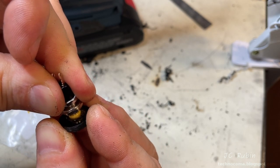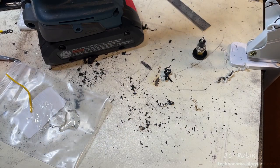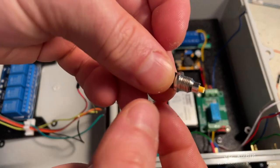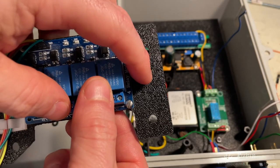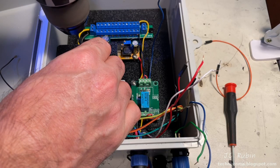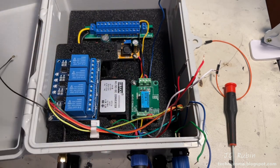I got ahead of myself — once you put the top piece on, there's no way to screw on the button through the board since it's through-hole. So I ripped that off and will put it back on later once I drill a hole through this board so it sits properly. I set up a pilot right here and drill a hole to install the button properly. There it is — now we can glue the cap back on.